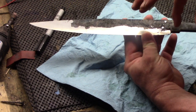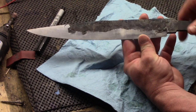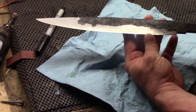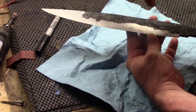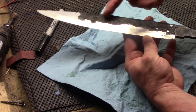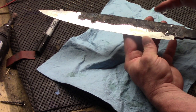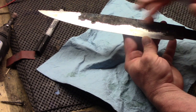And that process is a big shock. It's a huge jolt. You can actually feel the blade vibrating in the oil when that happens. This area here is the part that was exposed. It reached critical temperature, so when I quenched it, martensite formed. That means hardened steel, soft steel. This area through here did not convert to martensite because it never achieved critical temp because of the Satanite coating